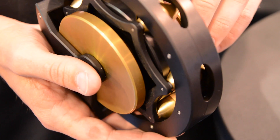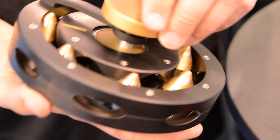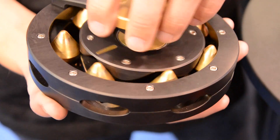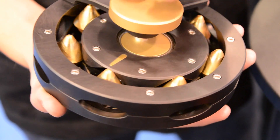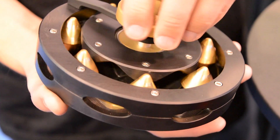The areas where we think it's going to make a really big impact are applications where efficiency matters, which is going to be the case more for robotics — especially for any kind of mobile robotic platform. If your transmission is only 50% efficient, that means that at least half of your energy is going into heat. Another area that we think is going to matter for robotics is simply having what we call low back-driving torque.